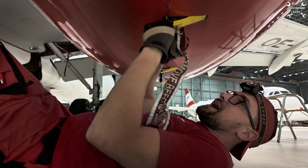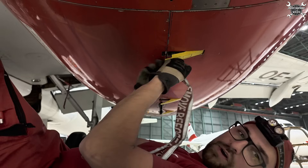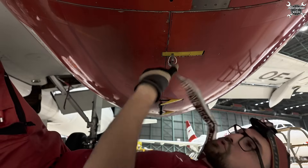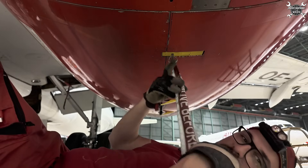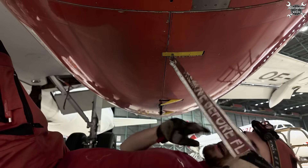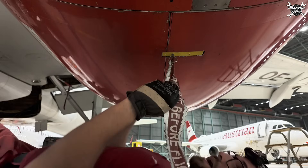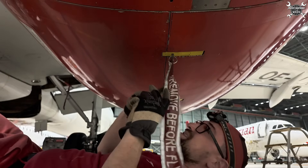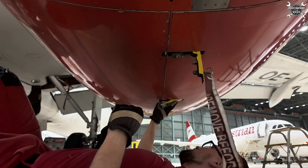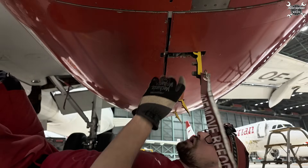Without the key it will not work, and the same way you cannot remove that key unless you properly close the latch. This is a safety feature, and this flag is a very important part of that key, because once you see such a thing under the engine — especially with these high-vis components — you will never miss it. So let's open it. It pops out: two and three. Now basically the fan cowls are free to open.